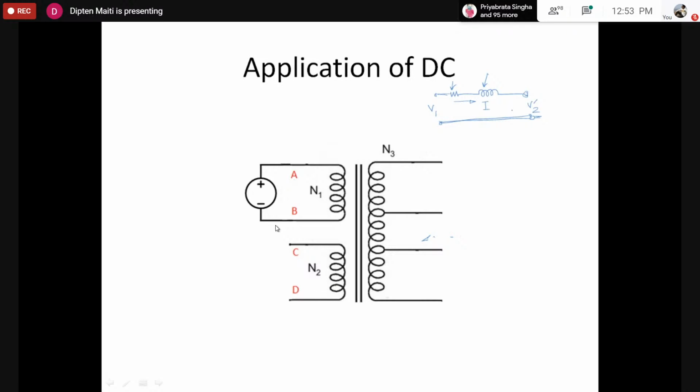If you say the magnetizing reactance, of course, that must be as high as possible. Leakage reactance must be as low as possible, very small, such that the voltage drop across the reactance and resistance combined at rated current is of the order of 5%. So if we apply, let's say 110 volt here, the voltage drop across this at rated current may be of the order of 5.5 volt, or roughly 6 volts.